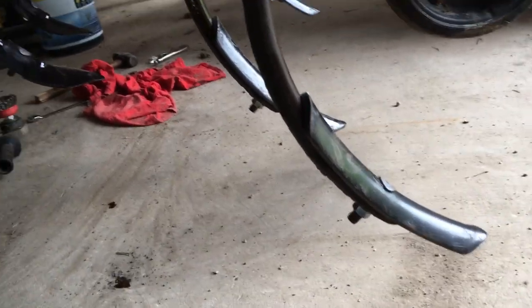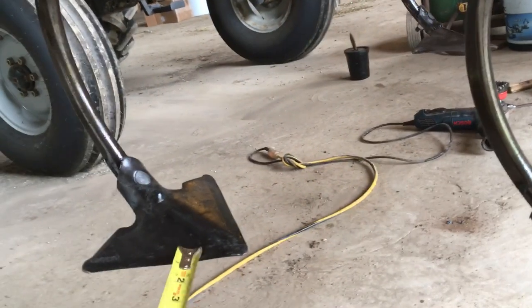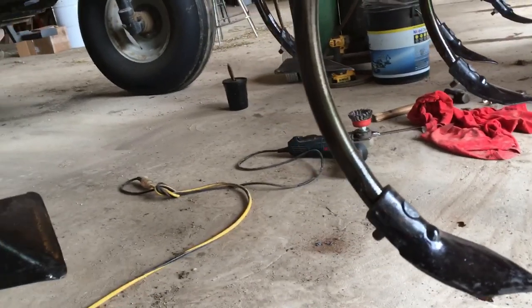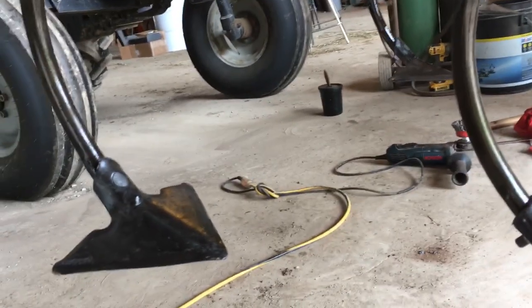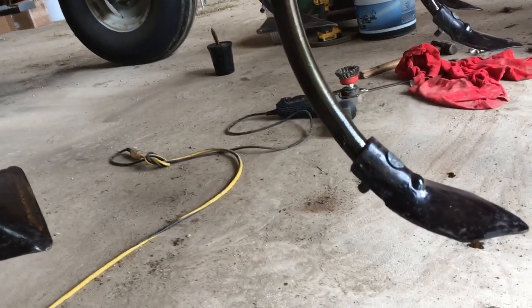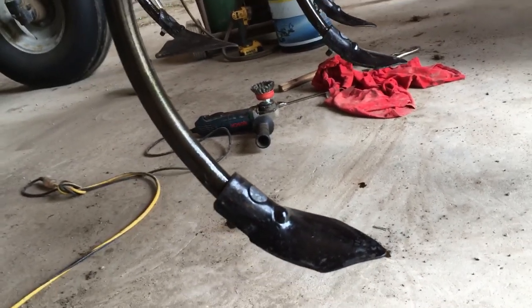The way my ridges are built, when I'm running that shank at a two-inch depth and I already have four-inch ridges, the back shank will be moving dirt — considerably deeper. If the front shank is at a one-inch depth, just because of the way the field is built following my planter, it will be running four or five inches deep and moving dirt. That center shank on the back will be the one determining the speed of the operation. The side shank running on a different part of the ridge will be somewhere between — if this one is at one inch on the very crown of a four-inch ridge, it'll put that one at around three or two inches.